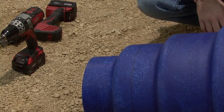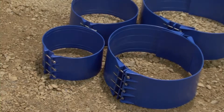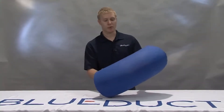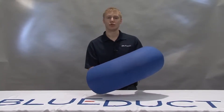Our clamps and gaskets for this size range come in two styles: one style for 6 through 10 inch, and a wider style for 12 through 48 inches. Here you can see our 90 degree elbow, which has a cutting guide molded directly into it, which allows you to cut any 90 degree elbow into two 45s.